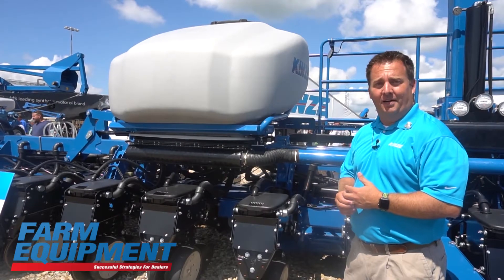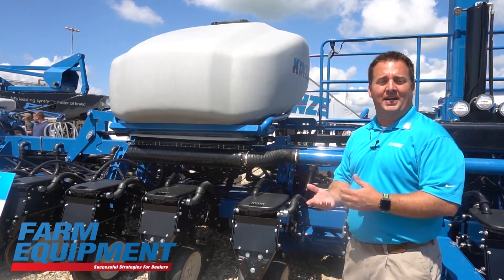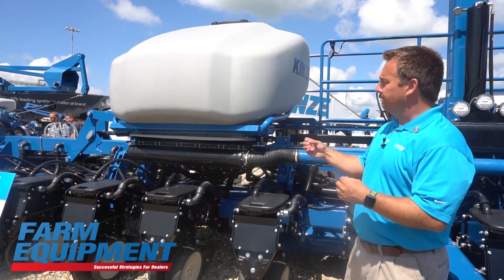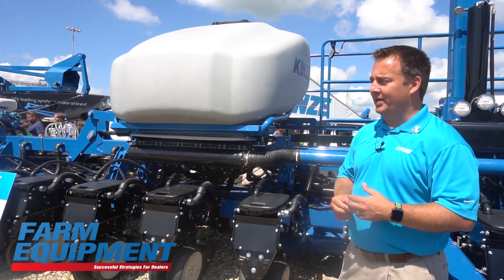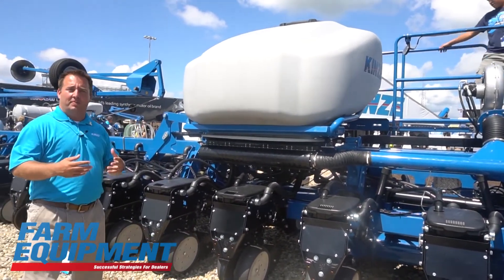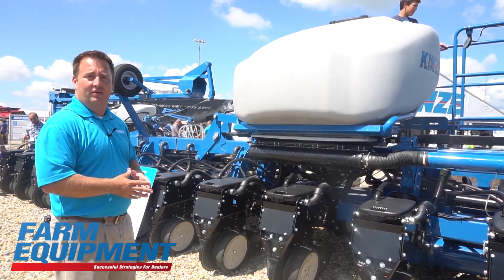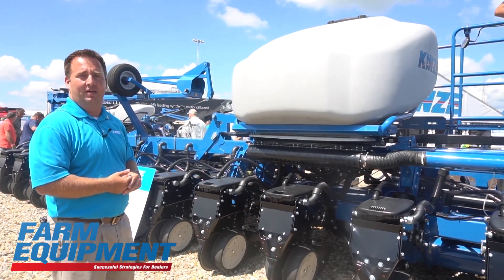With the 24-inch toolbar for better residue flow, we have our rock shaft underneath which pulls the tires under and provides an additional 14 inches of clearance when in transportation mode. Then when we use our bulk fill with positive airflow delivering seed to all the row units, we also use that oil to do our hydraulic weight transfer, which you can see over here. The hydraulic weight transfer cylinder distributes weight evenly across the width of the planter, lifting weight out of the center to reduce pinch row compaction — which costs yield — and keeps the outer row units in the ground at good, even, consistent depth for improved yield.